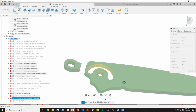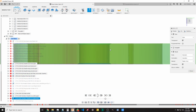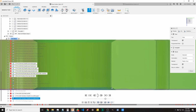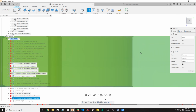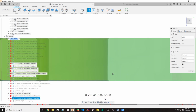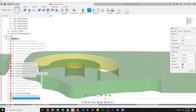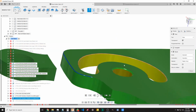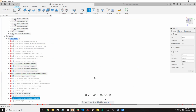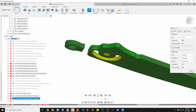and then we do a little side profile, you can see the pivot looks good, it's even top to bottom. Little chamfer right there, little chamfer right there, that's for the stop pin slot, looking really good. And even the micro chamfer around the outside is looking really good and even. This might actually work. So let's test it out in the machine now and see what we get.